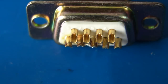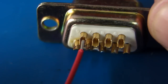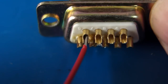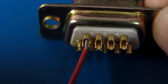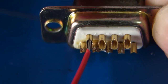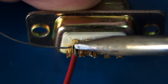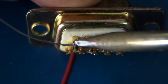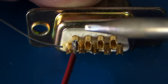There are two ways you can solder a connector like this. We've got our stripped multi-strand wire here. We could put that directly in there — let's strip off a little bit more and twist the stranded wires so they don't splay out. We can just sit it in there like that and come over with our solder. The problem with this is that you've got to have three hands — this is where those little helping hand things come in handy. I'm applying my tip to both the wire and the solder cup — you've got to heat up both — and you can come in with your solder. And you'll notice the solder just flows nicely into the cup like that.